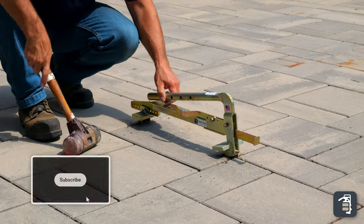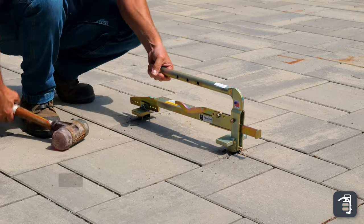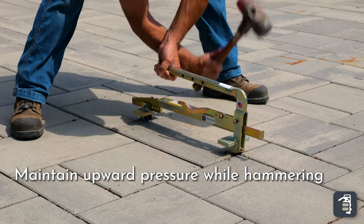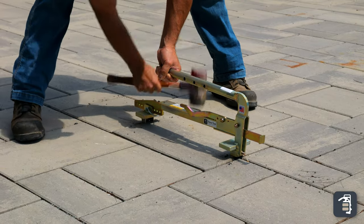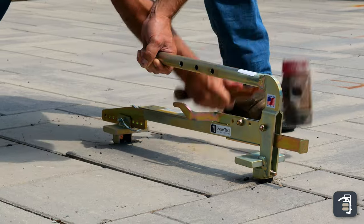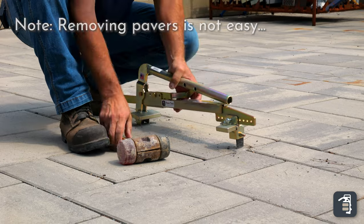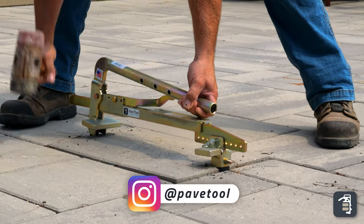I'm going to drive this down in until it's nice and tight. Then I'm going to pick up steady pressure — it's maybe just a little bit tight at this setting. Loosen it up one. You want this basically straight up and down. Then when I start picking up, I can put pressure, and what I'm going to do is just tap all these surrounding pavers. That's one nice part about the paver popper — it allows you to loosen this product up, and you can see the paver slowly lifting as I'm putting upward pressure. Sometimes I'll flip this around. You can see I've loosened up one side because that's where a lot of my pressure is, and I can loosen up this side. All that product in your joint is acting like a bunch of wedges.